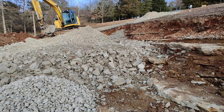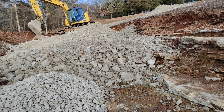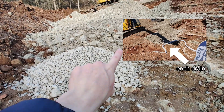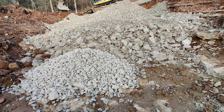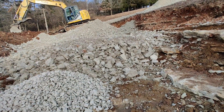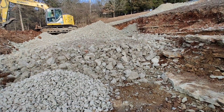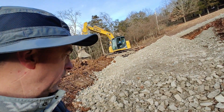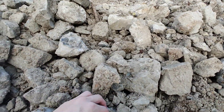What Bobby's doing now is bringing in this crushed limestone. This is the end of our French drain — you can see the difference in the rock we use. The water or any moisture will be able to go right into that. This other stuff is called a dirty rock — you have bigger pieces and smaller pieces.